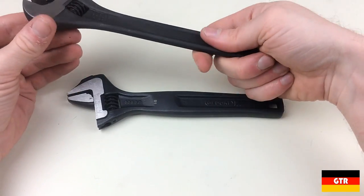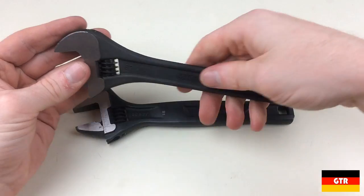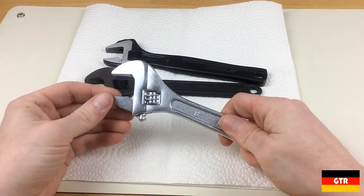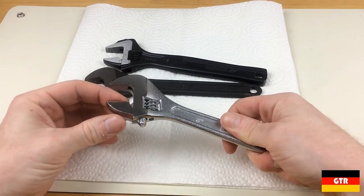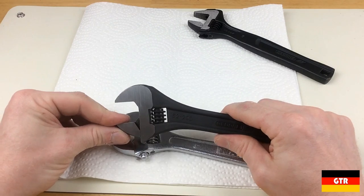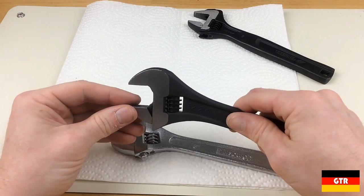The biggest difference you'll notice right away is the quality of the joint in the 62 series wrench. The amount of play or backlash on the movable jaw is actually the lowest I think I've ever seen out of any adjustable wrench. This amount of play in the lower jaw is generally a good measure of the quality of an adjustable wrench. Here is the world's cheapest adjustable 8 inch wrench — the Harbor Freight Pittsburgh 8 inch — you can pick it up for under $5. The jaw is about as loose as you can get while still technically being called an adjustable wrench. The 60 series is not as bad as the Harbor Freight, but still not great. The 62 series, on the other hand, has hardly any play in the joint at all. My theory is that the 62 series uses a significantly larger spring for the worm, which keeps it from moving as easily as you see in other adjustable wrenches.